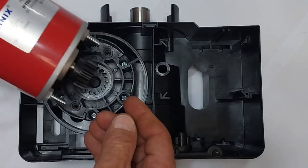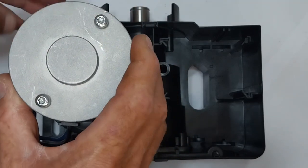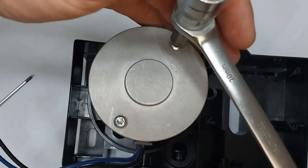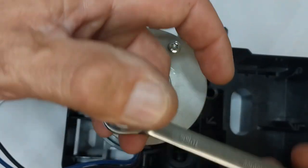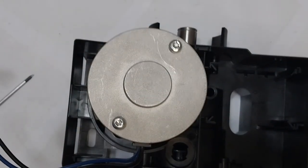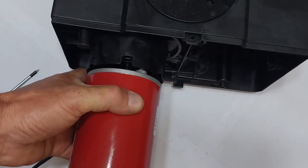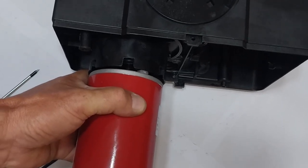So we keep it in this configuration — we put it over and wiggle it into place by fastening the bolts slowly, one at a time, until the whole motor is seated. Keep on screwing the screws in until they are well seated; do not force them. The base is just plastic and it will strip. While slowly turning the screws in, you will feel there is not a lot of obstruction and the motor will slide in all the way.